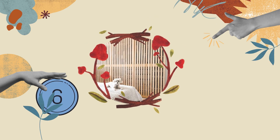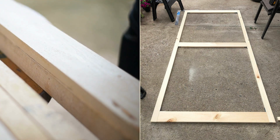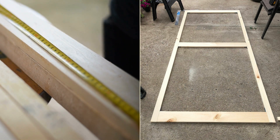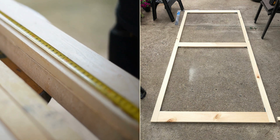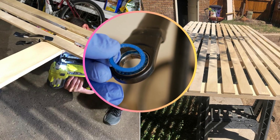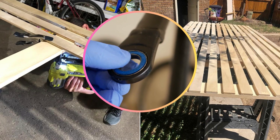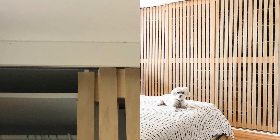Number 6: A DIY sliding closet doors idea. Measure your door dimensions, allowing for a 2-inch overlap for bypassing doors, then build sturdy frames using 1.5-inch corner braces and a middle wood brace for added strength. Attach slats with perfect alignment using a spacer for guidance and apply two coats of water-based urethane for wood protection. Install ball-bearing hangers, guides, and catchers for smooth sliding, and finally install a 1.5-inch by 3.5-inch trim along the ceiling opening to hide the metal tracks for a polished look.